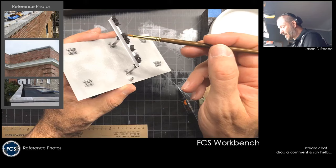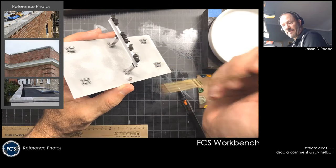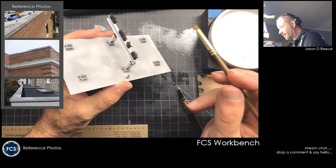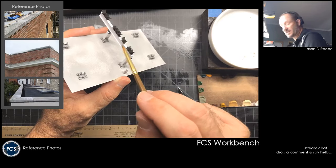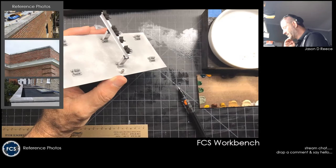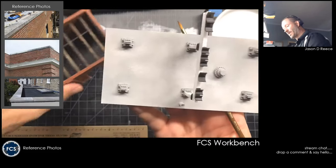And then every time the pipe hits one of these racks is an opportunity for that movement of the pipe for wear and tear to have rust streaks seep down on the saddle. So there's just lots of places there. So we'll work through that as we set our piping up on top.